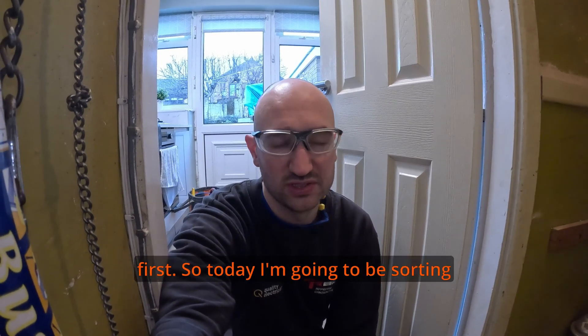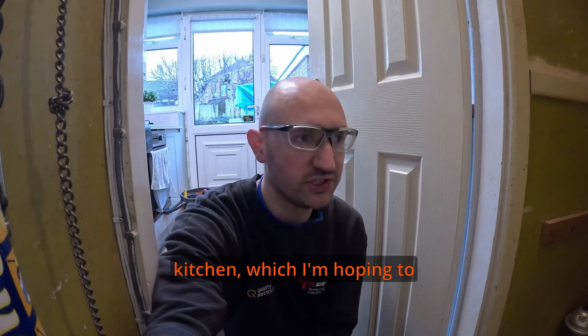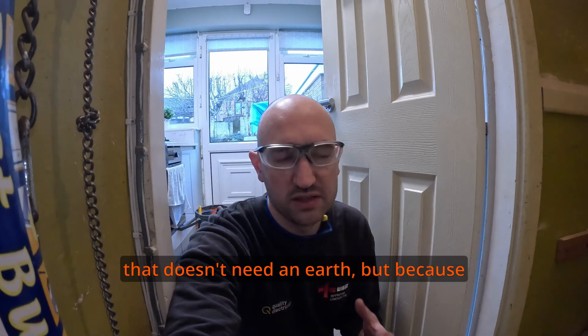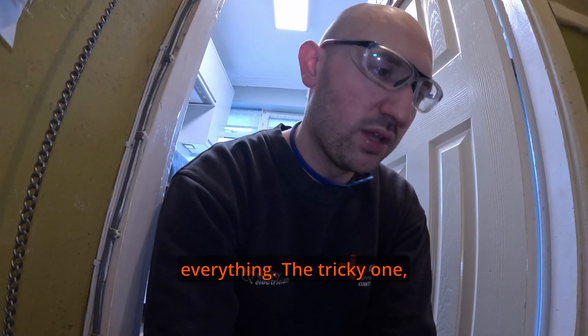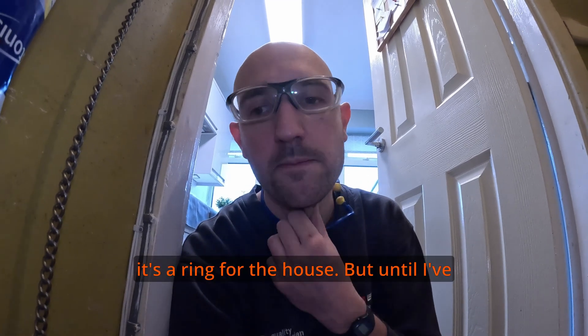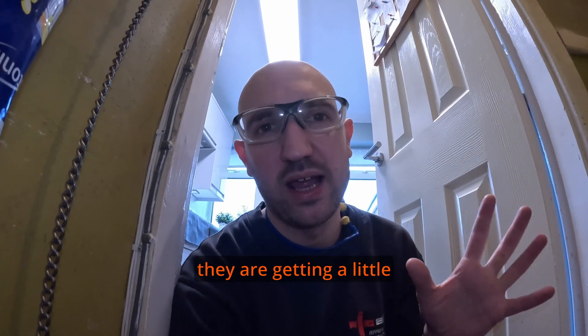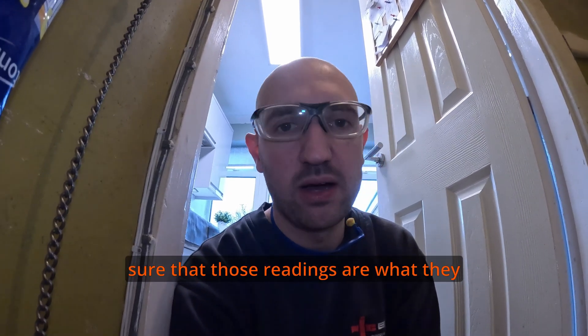Today I'm going to be sorting faults out, and tomorrow I'm going to swap the fuse board. We've got a loose earth connection which I think is a big group of cables shoved in a wall under the new kitchen, which I'm hoping to pull out. There are also a few metal fittings not earthed - they're class two so they don't need an earth, but because of how they've been terminated they do need earthing or re-terminating. The tricky one will be proving the sockets are on a ring main. The sockets are quite old so I'll take a few off and test behind them.